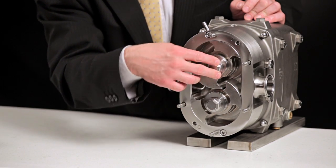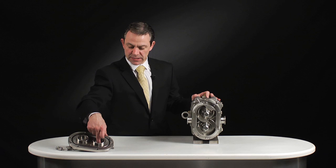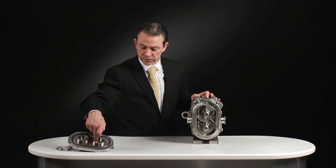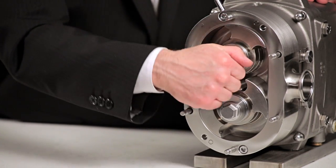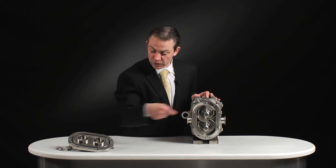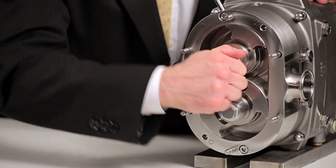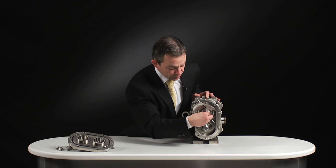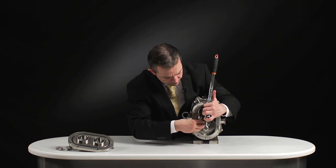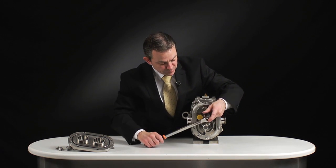You'll also notice these rotor nuts or rotor bolts are offset — they're designed offset to aid the pump. If product sets within the hub area, rather than the product acting like a spanner and undoing the rotor nuts, the rotor nuts will move elliptically round the centre and break up the product. It also means we get more velocity within the chamber itself, so you get a higher cleaning velocity during CIP. It also means you don't have to torque up these nuts as tight, because they're not running in the centre of the rotor so they can't physically unwind.